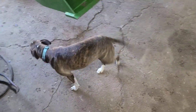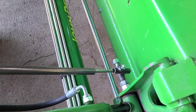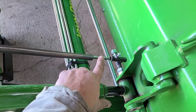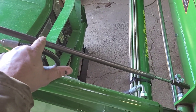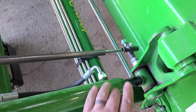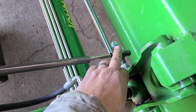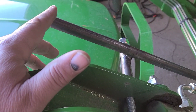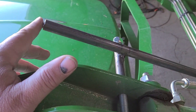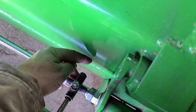It's warm outside — Brandy the wonder dog is loving it, she could stay outside most of the day. This is what we were shooting for, and I think it worked pretty good. We ran the bucket all the way down and locked it out, and the rod was still over halfway up into the tube, so there's plenty of overlap and we won't get any binding. We left a little space at the bottom so when the bucket's all the way back it won't bind there either. This little screw gives us an adjustment — once we get on flat ground I'll loosen it, make it flush, and that'll give us a bit more adjustment. Just got to make sure it doesn't hit the bucket.